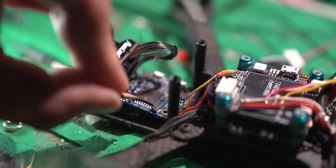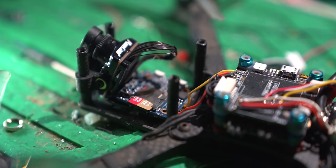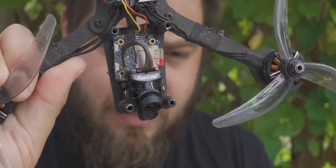It's also a single board camera. In the past, the RunCam Split has had multiple boards, which started to increase your stack size when you built the camera into your FPV stack. I have mine just VHB'd to the surface of the drone — that's just the way I wanted to do it and I really like it that way. The weight of the camera is only 18 grams. If you think about a normal FPV camera coming in at seven, eight, nine grams, you're really only adding 10 grams to your whole quad to add full 4K 30, 2.7K 60, whatever frame rate and resolution you want.